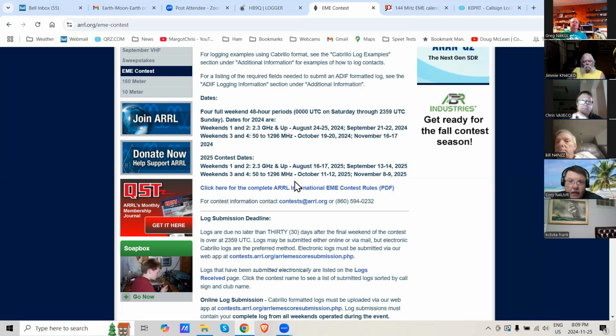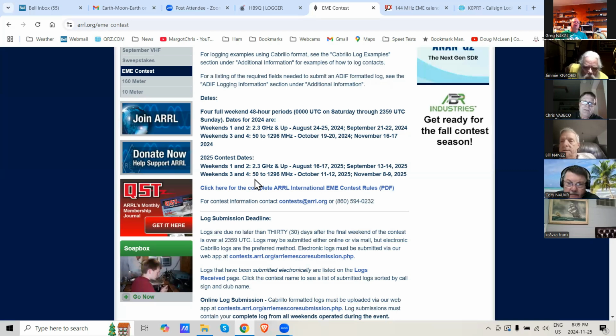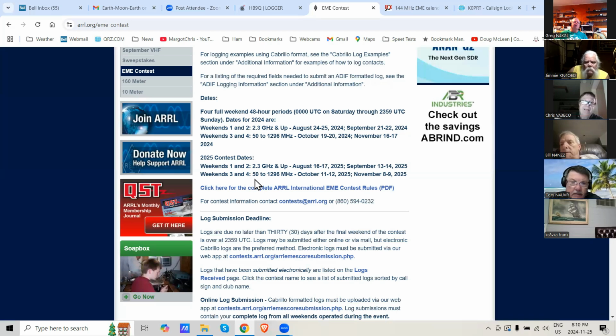Well, it's just passed, if you're up in the high frequencies. It's in August, September. It's on 2 different weekends for 50 megahertz, 6 meters. There are guys doing it on 6 meters, one in Montana in particular, who's got a super station. If you've got a good 6-meter antenna and a view of the eastern or western horizon without too many buildings or trees in the way, he's doable. His name is Lance. I forget his call sign, but 50 megahertz, 6 meters is tough to do, but it can be done, and he's done it all over the world. This guy does DXpeditions to exotic places with 6 meters, and his YouTubes are something to behold.